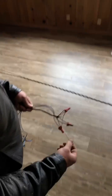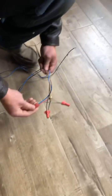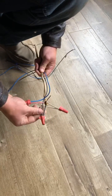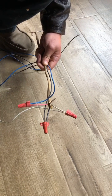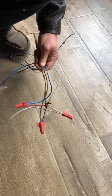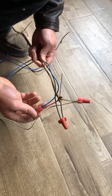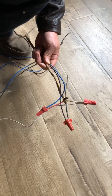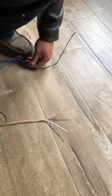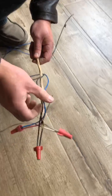So we know that the black wire goes with the black wire, the white wire goes with the white wire, the ground goes to ground. And it's odd, but this blue wire goes to the red wire. So if you've got wires sticking out of your wall that look like this, that's how you're going to hook it up.